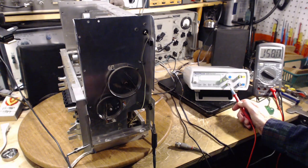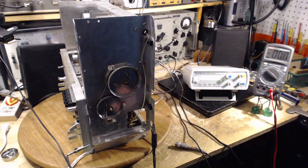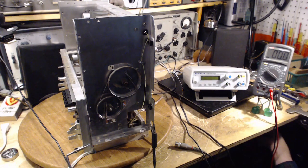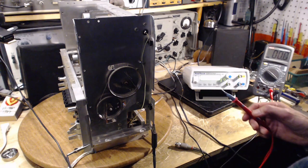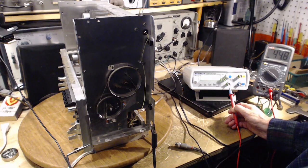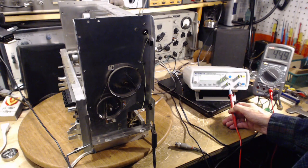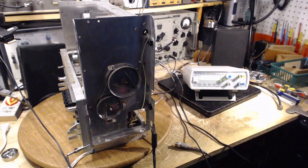Go from here to a grounded thing. 44 volts. So that's an eye catcher for sure. I wouldn't want to ignore that. But I think it's 44 volts with no oomph behind it whatsoever. Okay, just reverse the plug. 44 again. I was kind of figuring I'd see the other half. 44. Again, I think it's just a capacitive effect.